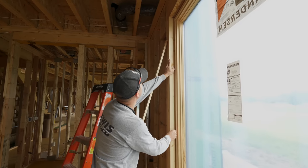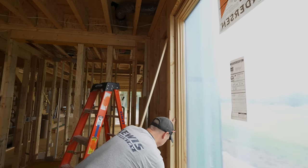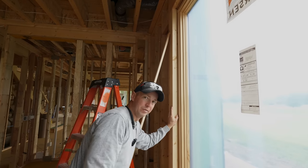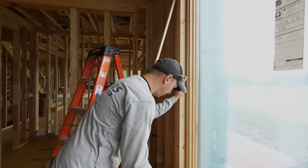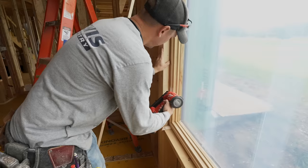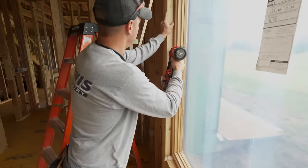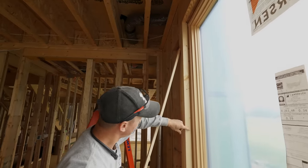After I've got my pieces ripped, we're going to staple these on. I find that the 18-gauge stapler works pretty well — finished nails don't quite have the holding power that we need, so an 18-gauge stapler is ideal. We can just go along here and nail this on.